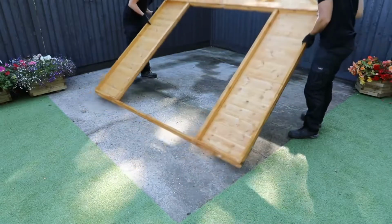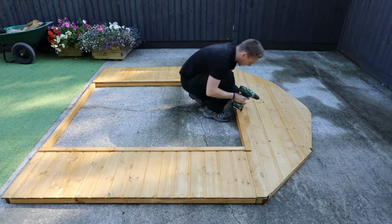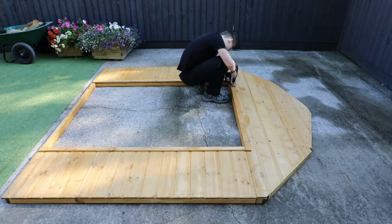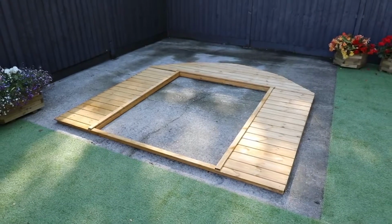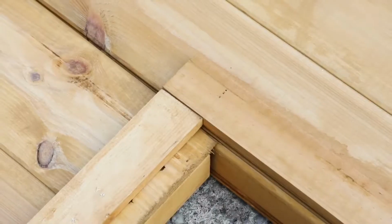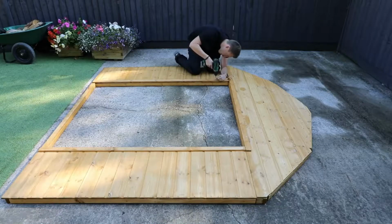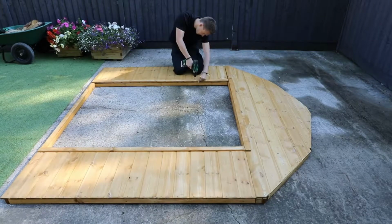Carefully flip the door panel over. Align the 1449mm door strip at the top of the frame and secure in place using 4 30mm screws. Place the left and right door strips flush with the end of the top strip. This will leave a gap between the strip and the door frame as shown. Secure each strip with 4 evenly spaced 30mm screws.